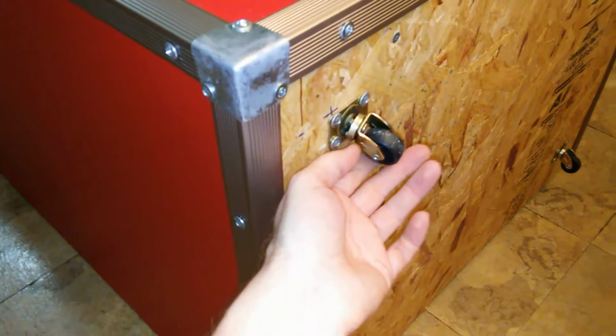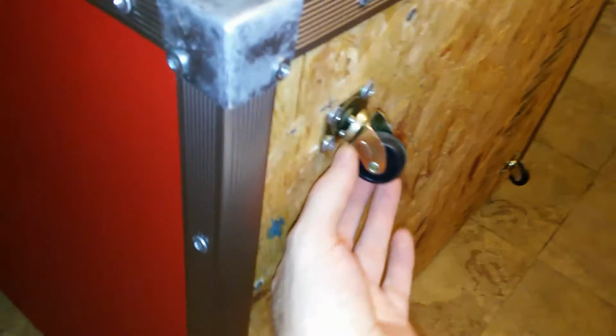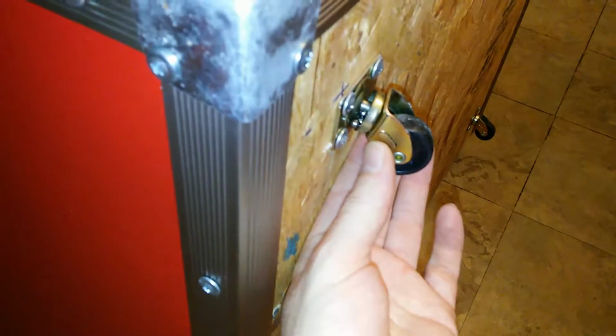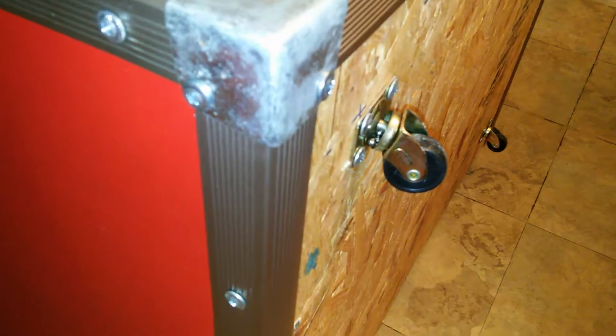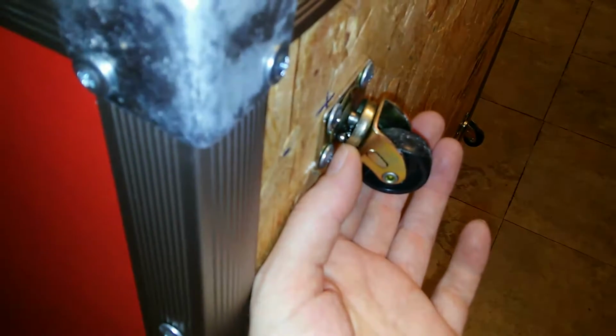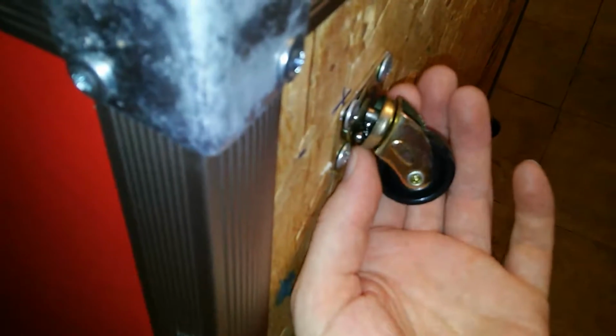But these caster wheels, as I also mentioned, are about 1.25 inch, the smallest ones I could find at Home Depot. And you can actually see, good lord, it busted 2 of them. Well, this is a good opportunity, actually. I thought it just busted 1. When I was moving it and it was in the garage, it came down a little hard on one of the wheels, and the ball bearings actually flew out of the caster wheel, which of course are what allow it to rotate smoothly. I replaced the one that was damaged, but I can see now there's a second one damaged. You can actually see the bearings. There's one of them. They're loose, so I have to replace this one as well.